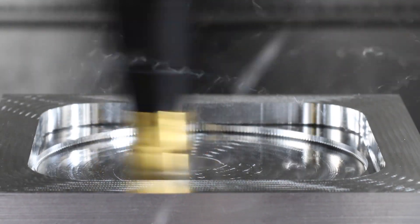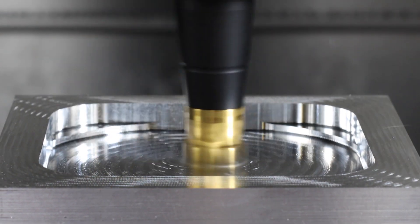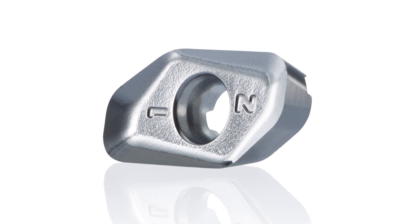It is available in diameters as small as 16 millimeter and is ideal for sticky aluminum environments with high spindle speeds and feed rates. But as well as being great on those high performance machining centers, it is also really effective on lower RPM machines. The inserts are precision ground for an exceptionally accurate 90-degree sidewall machining and with six different insert corner radii options, you have the flexibility to handle a wider range of workpiece features.